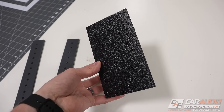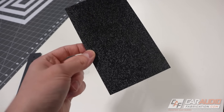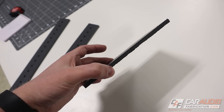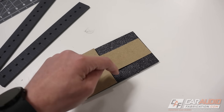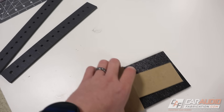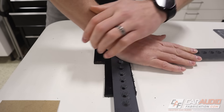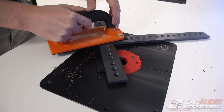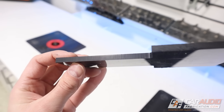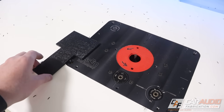I'm going to head over to the table saw and get a little piece of plastic cut. The material I'm using is a quarter-inch thick piece of ABS. ABS has really high temperature resistance, so it will be able to withstand the heat inside the engine compartment, and being nice and thick like this, it's going to be more than strong enough. I take my cardboard template and transfer the cuts to the piece of plastic, rough-cut with the jigsaw, then use straight templates and template tape on the router with a flush trim bit to make perfect straight cuts. This router bit is a special flush trim bit meant just for plastics — it gives a really nice clean edge and cuts like butter.